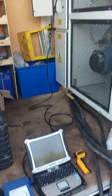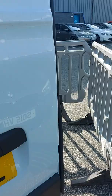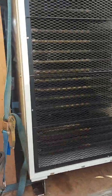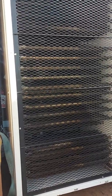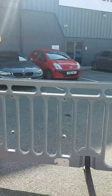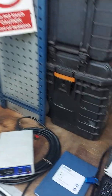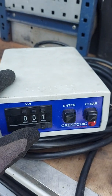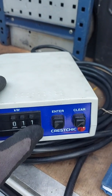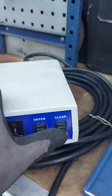So I'll quickly run through the setup. This is what's known as a resistive load bank. I use it in the back of my van. There's a safe area at the back because it does blow out warm air, and those are basically resistive elements or heater elements which I can individually switch on using a control device. This one is a basic one — you can put load on in 1kW at a time, 10kW at a time, 100kW; you can put whatever you want on and just bang it on or take it off.